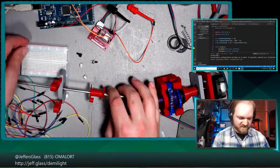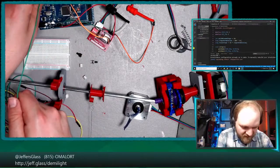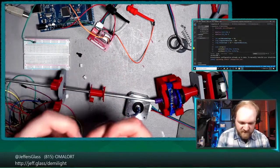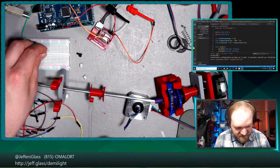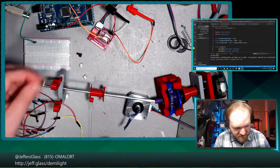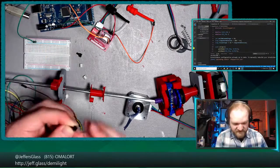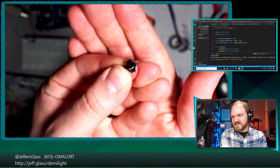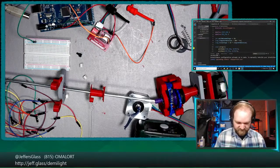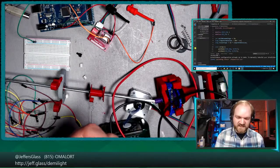So we'll get our breadboard there. Let's just unplug this from power. We'll bring a ground connection over. We'll put in a couple of these little tactile switches. I think they're meant to go like so. Guess I should confirm. So these are a little 4-pin tactile switch, and I can never remember which direction the pins are paired in. It's a single pole, single throw switch. So let me just take my meter here just briefly.